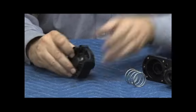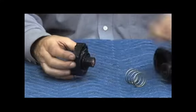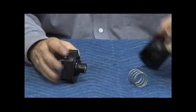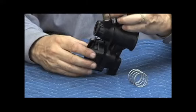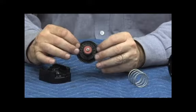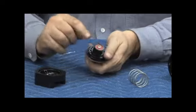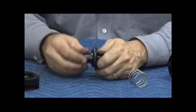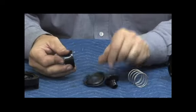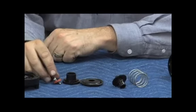High pressure sensing line comes through the cover, which comes out through the cover right there. And that brings out our high pressure sensing line right there. Now, low pressure sensing line comes from the body inside here, so it is a hydraulically balanced relief valve. We're utilizing a rolling diaphragm, relatively small roll, easy, and there's our relief valve disc. Disassemble the relief valve stem. One screw holds the stem together, similar again to the 975 relief valve. RV plunger, rolling diaphragm, upper plunger, relief valve disc, assembly bolt.